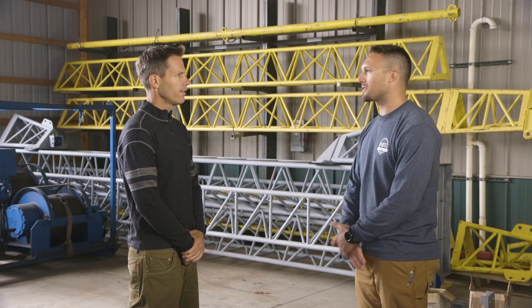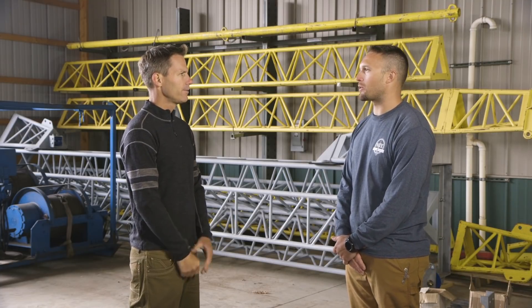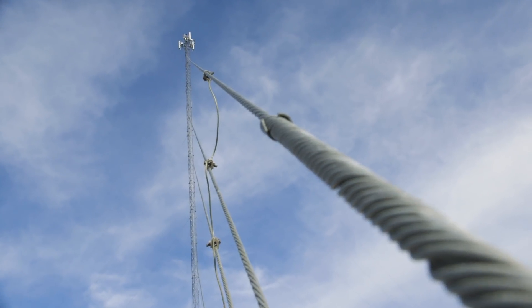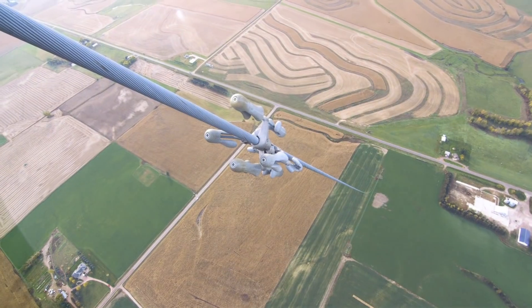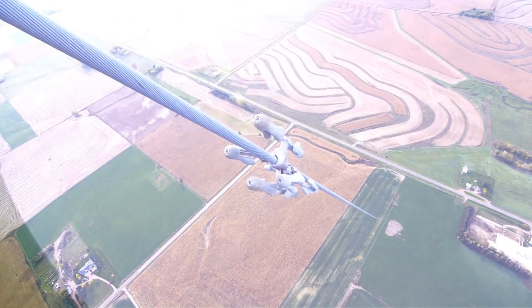Tell me about guy wire modifications. Replacing or disconnecting guy wires generally requires temporary guy support — same rules apply. Always follow the approved rigging plan, because sometimes the engineer may want to replace guy wires higher up on the structure first. And when in doubt, work with the responsible people listed on your rigging plan.